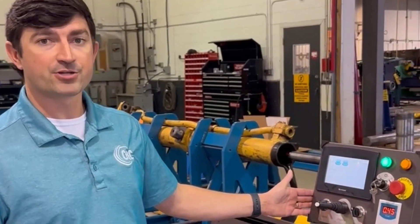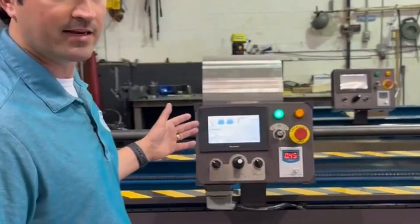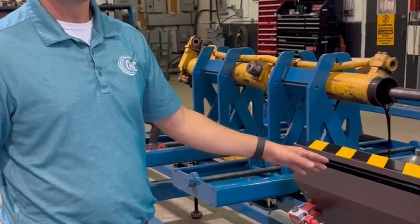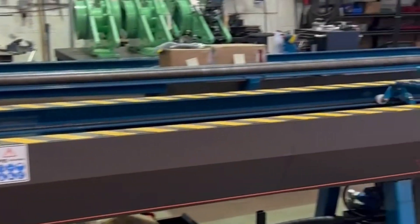This machine was designed specifically for hydraulic repair shops. With the ease of use, functionality, and automated features, it saves you time and money. The initial setup for the honing stones starts at 2½ inch up to a 5½ inch bore, and you can increase that capacity up to 21 inches with the additional purchase of the master holders and the stone supports.